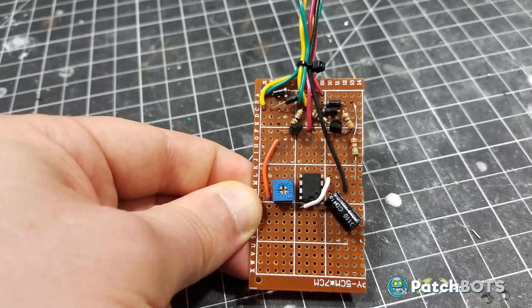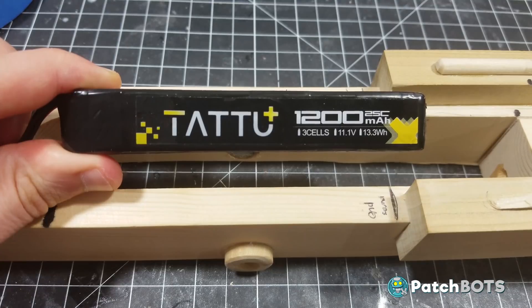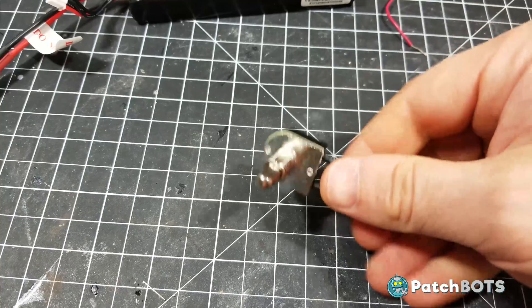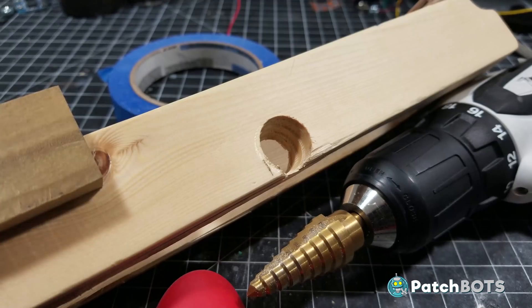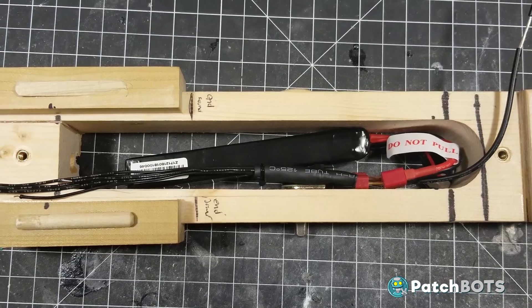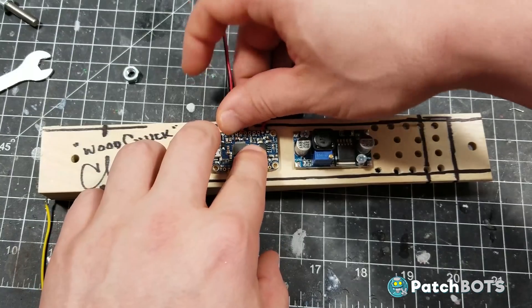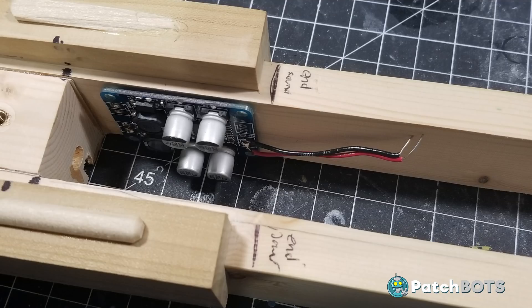I consolidated that whole circuit down to this little board that will fit inside the handle, then we can start wiring everything up to power. I found these awesome little stick-style LiPo batteries. This 11.1 volt LiPo will be our power supply and it just so happens to fit into the Woodchuck electronics cavity with ease. This battery doesn't have a ton of life to it, so I'm going to add in a main power switch so I can turn everything off when not using it. The DC-15 has these small circular greeblies on each side — I'm thinking I can drill through that and have the arm of the switch poke through. I ended up making a pretty large hole so I can print a switch mount to hold the switch into place, and I can reprint a matching circular greebly with a slightly lower profile so the end of the button sticks out enough to push. As you can see with just the switch and battery we're already getting a little congested in here. Luckily the sound trigger and the voltage converter are very small and can be mounted onto the lid of the electronics cavity, though this means covering up Woodchuck's name, which I hate to do but it's definitely for the greater good. The amplifier is just a bit too big to mount to the lid but still fits nicely along the inner wall.